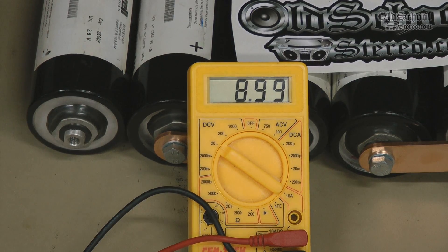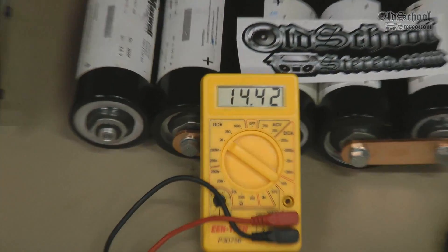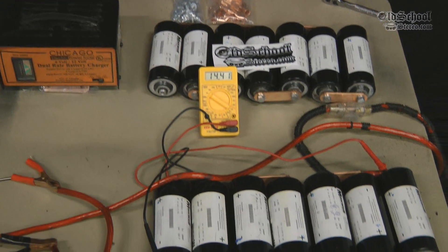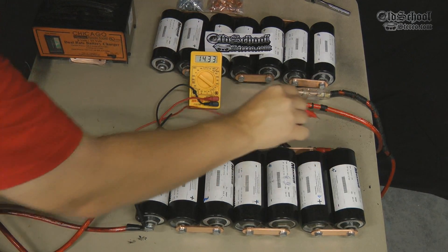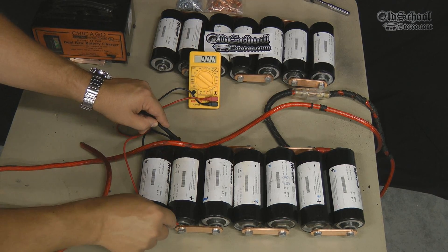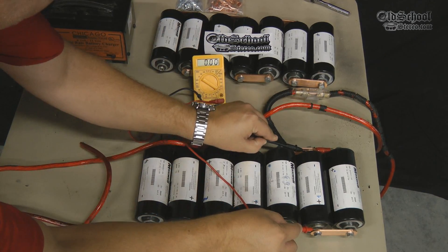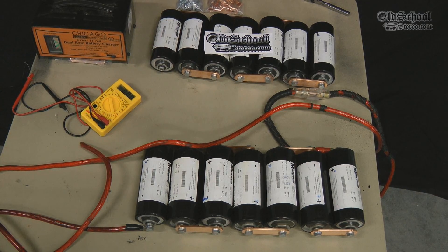That should take it up to around 14 and a half volts. There you see 14.43 volts — that's charged up as much as this cheap old charger will do. We've got the caps charged up to 14.4 volts. Now the next thing I always like to do is check each cap's individual voltage. Since I don't have balancing resistors on them, you need to make sure none of them are above 2.5 to 2.6 volts, in case one of the caps is dead and the other one has to take over the charge. Checking each cell — they're right at two volts. They're pretty well balanced, very close to two volts apiece, and they can handle up to 2.5 volts. So we should be good there.